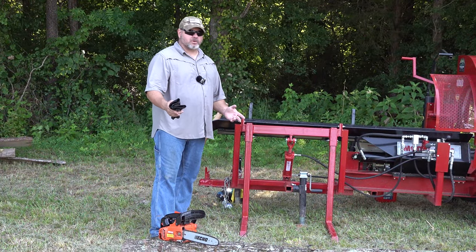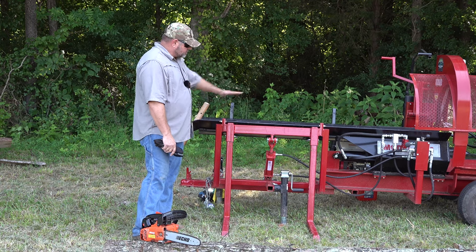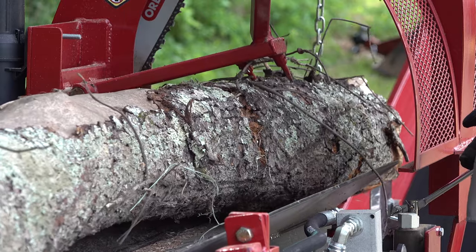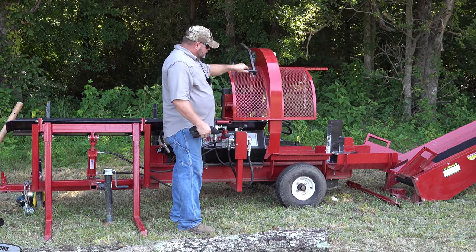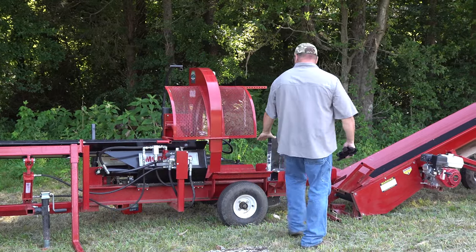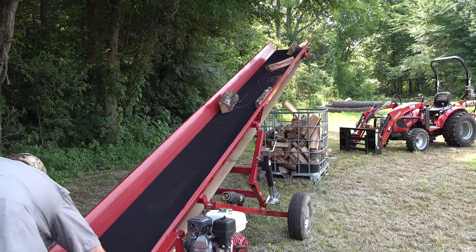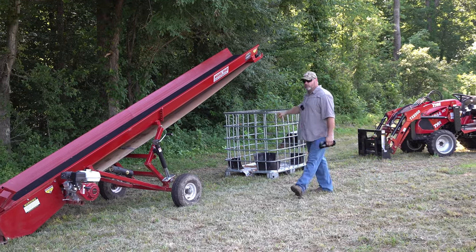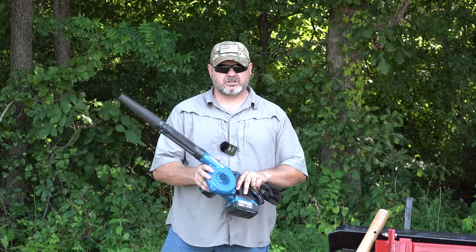We're going to walk you through the process and then actually show it work. We roll the log onto these arms, the arms lift up, they go onto the deck. This deck is tied into the splitter itself and it moves back and forth. You roll the log up here and then move the deck forward. As we move the deck forward, you have a holder here that keeps the log from coming back, and you slide the deck basically out from under the log. Then it has a 20-inch bar chainsaw right here that's run off the hydraulic — very, very strong. You saw the log off and then it drops the end into the splitter area. From there, you can set the splitter head up and down and it will split out, go up the conveyor belt, and drop into your container. We also keep a tractor — a little T264 tractor with forks on it — along with a chainsaw and a cant hook. I recommend a little battery-powered blower so you can blow off all the excess chips and just keep your equipment clean.